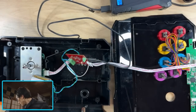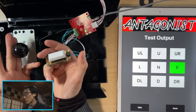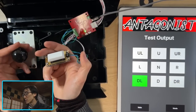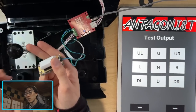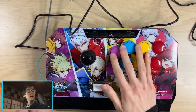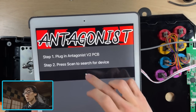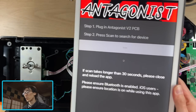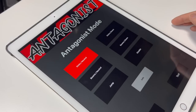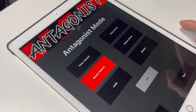There's no need to get a soldering iron out, but you will have to Google your current arcade stick to find out which wire is which. The Antagonist requires five volts of power. If you're using a Brook fighting board, there's often a five-volt power supply you can connect to, but if your PCB isn't accessible or just doesn't provide a place to steal power from, you can actually power the Antagonist using the micro USB port and something like a mobile battery. Once you've plugged in the PCB and attached your new button, the next thing you want to do is program the button itself. It doesn't involve code — in fact, you don't even need a computer, because the Antagonist can be set up entirely through Bluetooth and a free app you download to your phone. The app is straightforward, and to choose how the Antagonist behaves, you just select from one of the five modes.